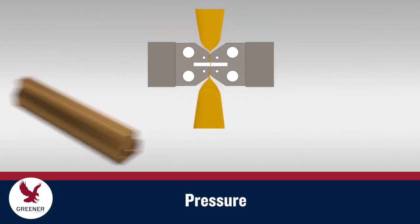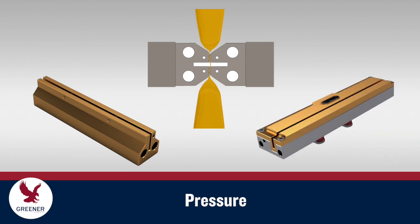Machine adjustments and customized sealing jaw designs can provide greater pressure and better surface contact between the packaging material and the sealing jaw serrations. More heat is driven through to the sealant layer within a given time period and temperatures can be reduced.